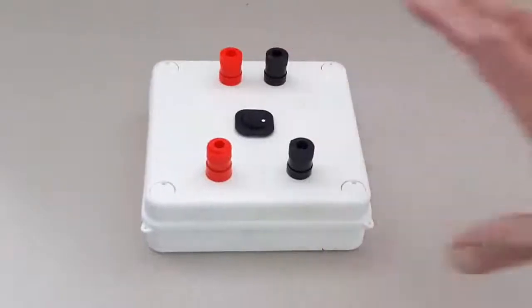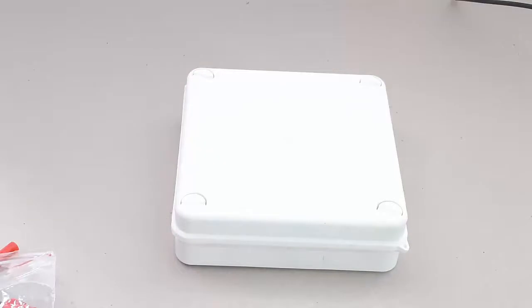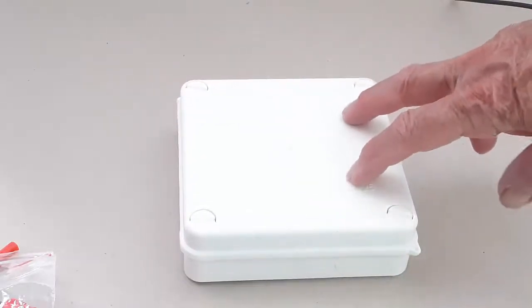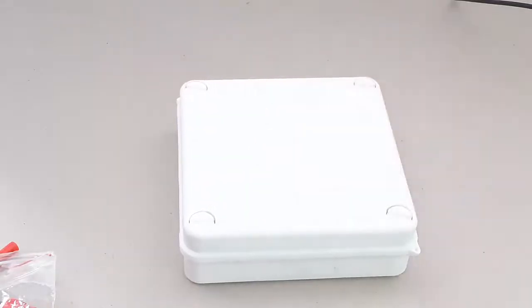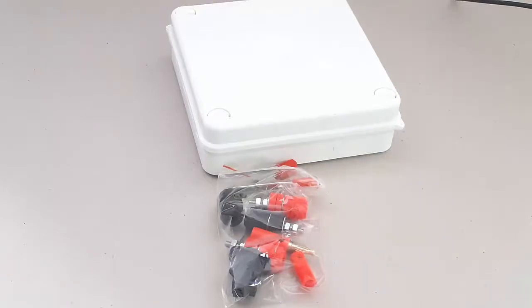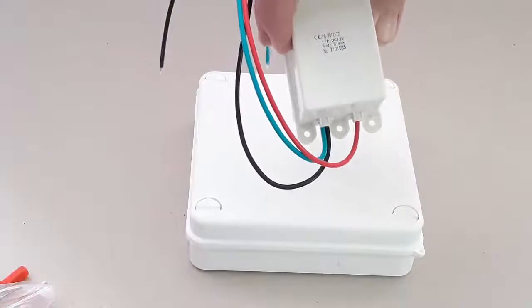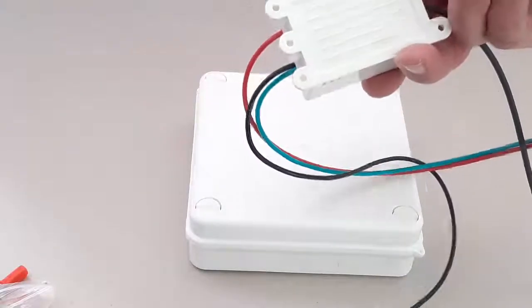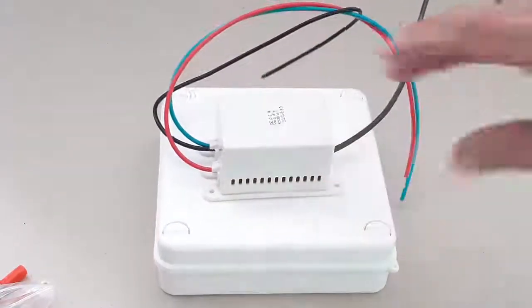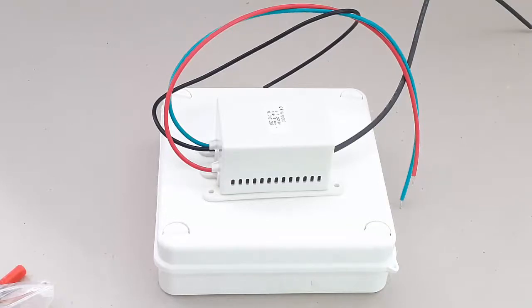It's flat, portable, and lays where you want it. When the kit comes to you, you get a styrene box, insulated. You'll have to drill a few holes — two small holes and one for a switch. You'll get a package of parts, everything you need to make the control unit. The heart of the kit is a 12-volt DC input, 15-kilovolt DC output — very powerful. You won't find anything else like it on the market. It's especially designed for static grass applicators and flock boxes, though you can use it for other things too.